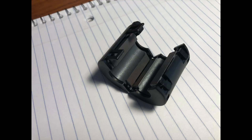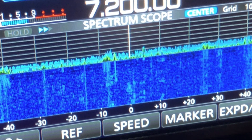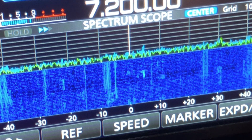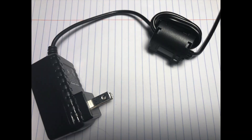The interference seemed to be coming from my Raspberry Pi. So I broke out a ferrite bead I had bought for some different issues, and I wrapped it around the USB cable. I was only able to get four passes, and I think that typically you want a little bit more than that. Here you can see that as I apply the ferrite bead, the interference subsides somewhat, but the results were not exactly what I was looking for. So I decided to move the ferrite bead from the USB cable — I'll add one back to the USB cable later — and put it onto the power cable for the Raspberry Pi 4.